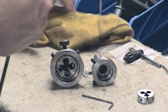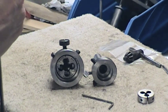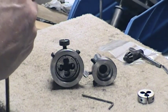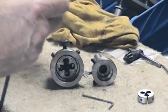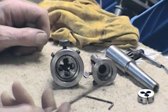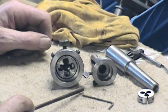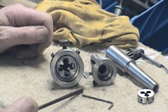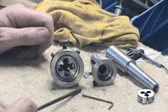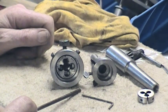I mentioned about starting a thread in the drilling machine with a tap. Now this is something I made for the lathe - I just noticed some corrosion, it's a problem. Anyway, this was an attempt to help get started on a thread with a die. We'll assume the workpiece is in the three jaw, and we're just looking to make a start for a couple of turns, maybe not winding on all the way. This is just a means of starting off.